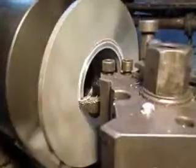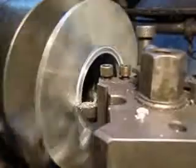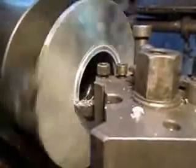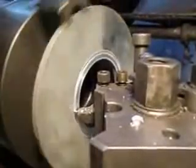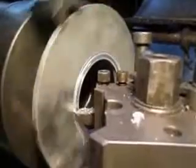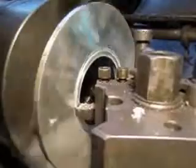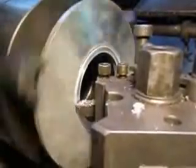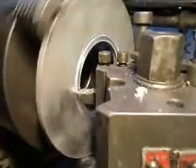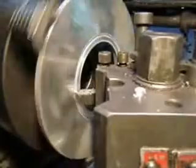What I'm actually going to do is cut two rings out of this, a smaller one and a larger one, and just kind of do a step up to cut the rings. We'll do that twice of course, because we need four rings. And then that should fit around the sphere fairly smoothly. We want three quarters of an inch distance between the sphere and the inner ring.